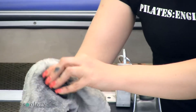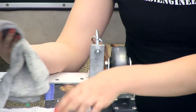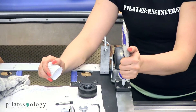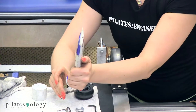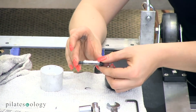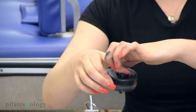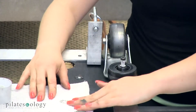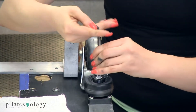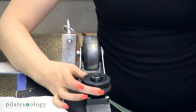We'll also clean the wheel itself. Once it's all clean, we'll put it all back together. We'll take our white lithium grease and put a drop on the block, then put a line on the bolt. Now we'll put everything back together, spinning the bolt as you put it in to make sure it lubricates evenly, then put the whole thing back on the block. Use your Allen wrench to tighten it up — these tighten all the way and will actually lock into position, and the wheel will still spin. That's how you service the small wheels.